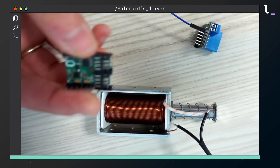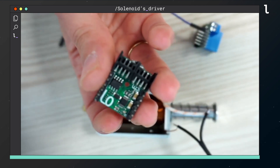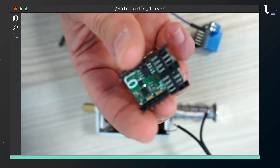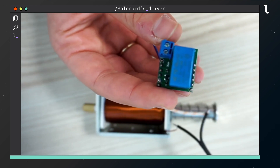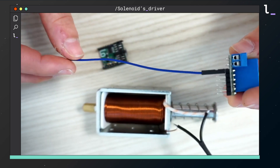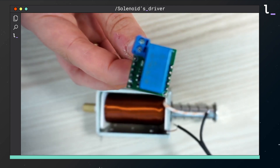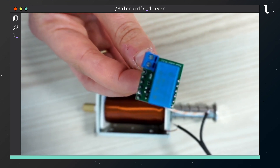For the solenoids driver I'm using a LUOS custom STM32L0-based microcontroller made only for prototyping and testing purposes, but you can use a different microcontroller that you prefer for your driver. To drive the solenoid we created a power switch shield. The input pin of the power switch will be set to 1 when we want to activate the solenoid and to 0 when we want it deactivated. Make sure that you use a relay in your shield for 12V devices, otherwise you will burn out your microcontroller.